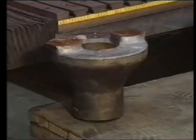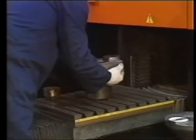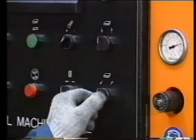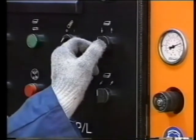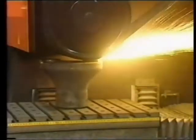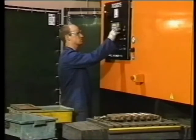There are two main modes of operation. Manual allows for movement of the reciprocating bed for alignment of the part or fixture. The table can be moved up and down, in and out. The RGS 875 has the ability to grind in both directions, greatly reducing cycle times. A comfortable loading height can also be set by the operator through the interface.